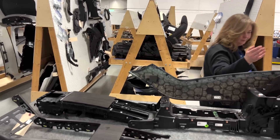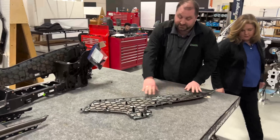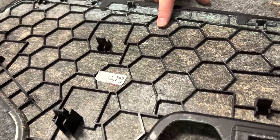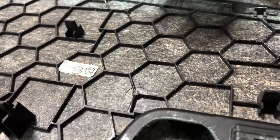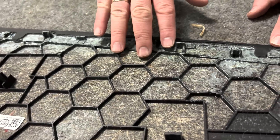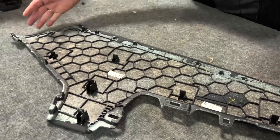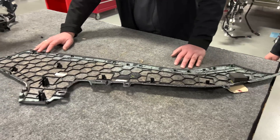Coming over here to the panel — this is a trim side panel for the center console. Look at the material this is made out of. This was actually made in several steps. This background material is a natural fiber reinforced, most likely polypropylene plastic. This is compression molded. These ribbings are then overmolded over top of this compression molded sheet. What's the benefit of that? Why didn't you just mold a panel since you already had to pay for an injection mold that entire size to do all this ribbing? Well, it's because of lightweighting.